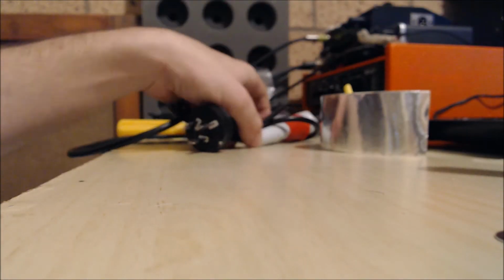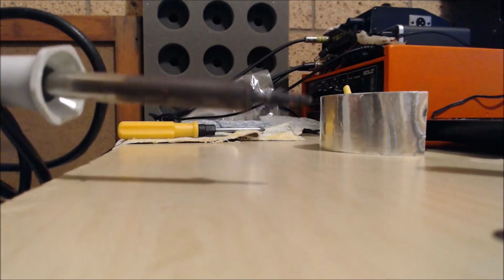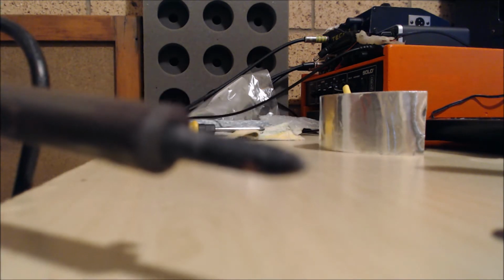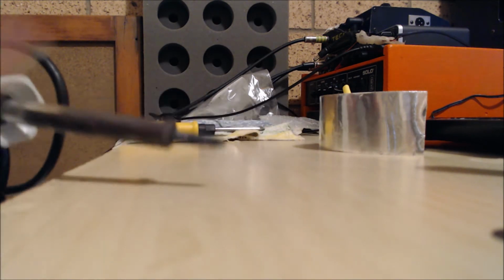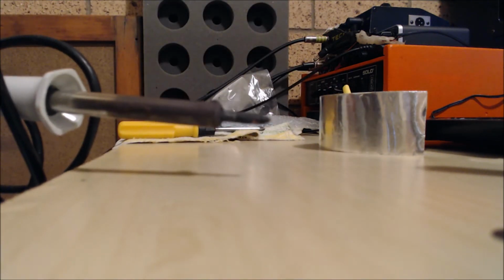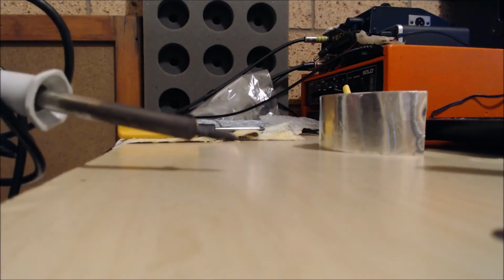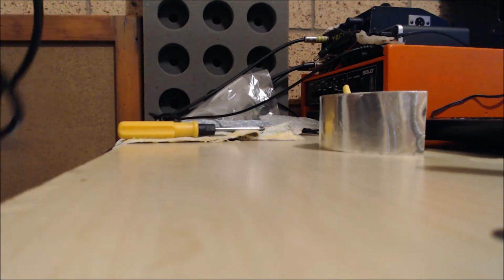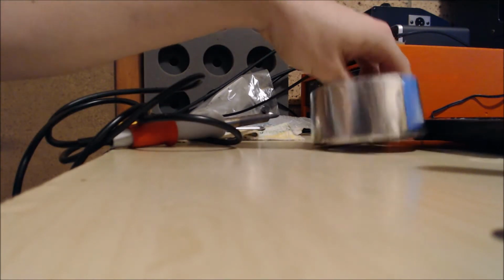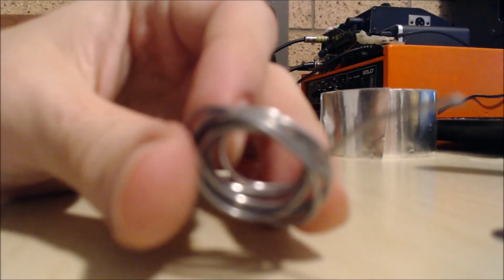And what else? Of course, your standard soldering iron. Mine's a really shitty soldering iron. I need to give it a new tip and re-tin that tip, because I didn't do that, so I have to constantly scrape off the residue with some sort of metal implement before it actually wants to work. But once you get into the habit of using that technique, it works pretty well. So just a normal soldering iron, some sort of rosin or flux core solder, if it will focus.